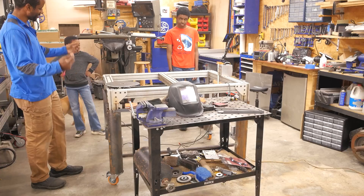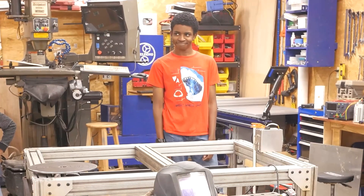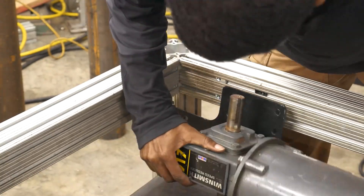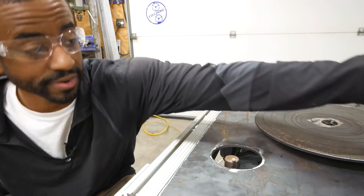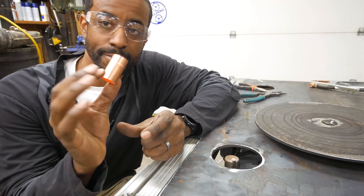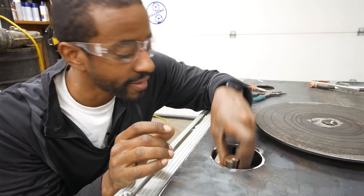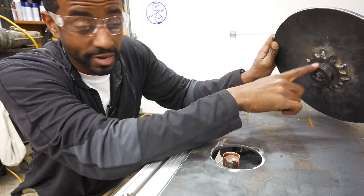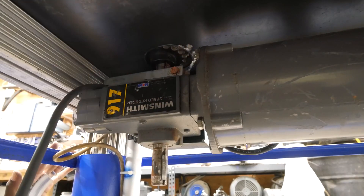Don't miss his son's reaction when he considers leaving the steel unfinished — it's priceless. He's also adding a rotary table to make welds around pipes more consistent. The tricky part is making sure that part of the table is grounded when he's working on it. He uses a sleeve of copper that presses against the base of the rotary table courtesy of a spring. Once he clamps a grounding cable to the sleeve, he's got a good ground.